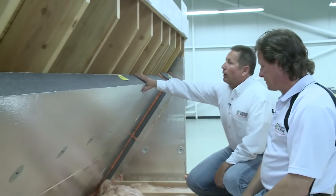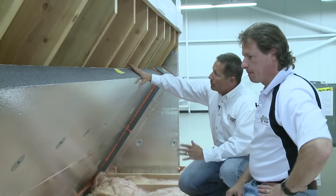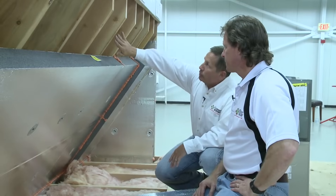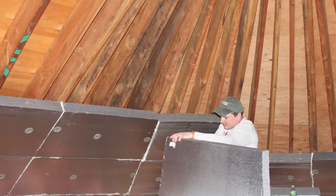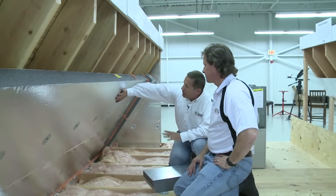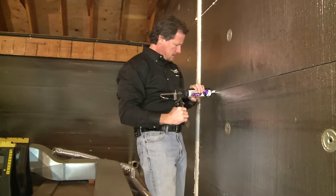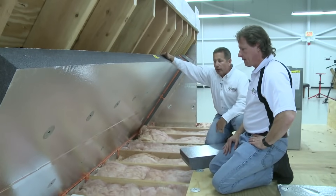So what's this called? This is called Silver Glow, and we actually call it Super Attic after we put the Silver Glow up. It's pretty simple, actually. It's a four-inch piece of foam board insulation fastened to the underside of the roof all the way down — going all the way up to the top and then all the way down to the floor joists below. By putting those in, we've set the insulation boundary up here on the underside of the roof. Each of these pieces are foamed, taped, and sealed so we've also prevented any air from leaking through to the outside.